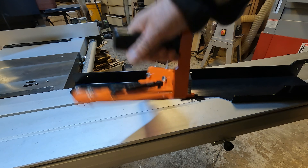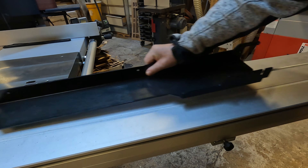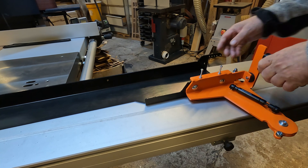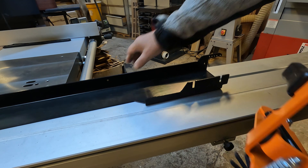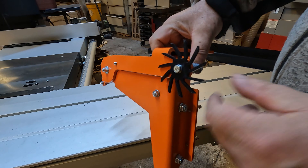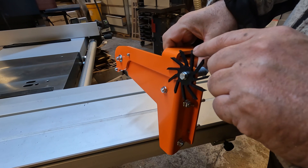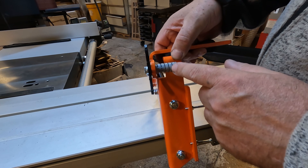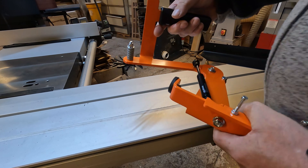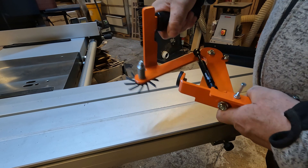Here you can see the parts that are included. It's the cutter head itself and the blade guard. You change the blade guard on the sawmill to this one that is special for the pre-cutter, and you put this on like this. There is a cutter knife in front here, so this will scrape away everything from the bark. And if it hits a knot or something, this can rotate — but it's on a heavy spring, so it's really stiff. Then you flip it out and go against the log. There's a shock or compressed air that pushes it against the log.